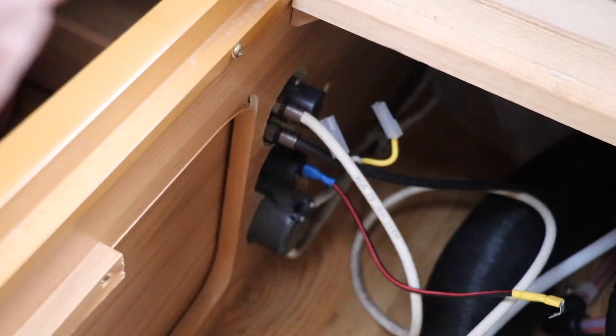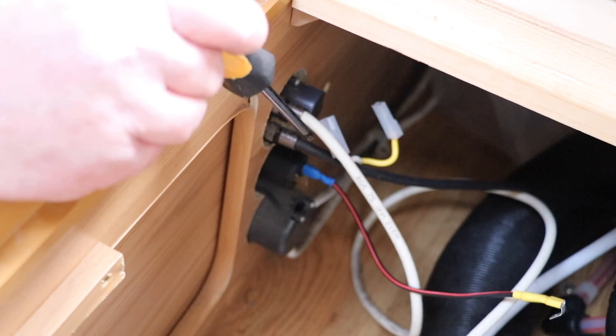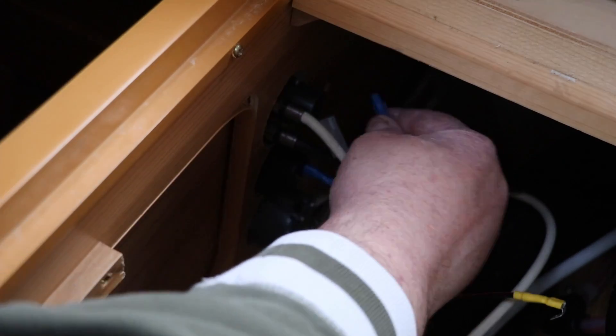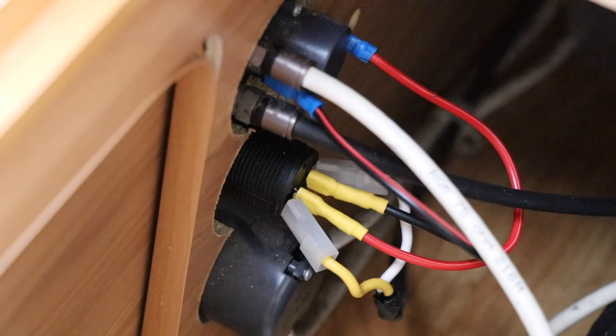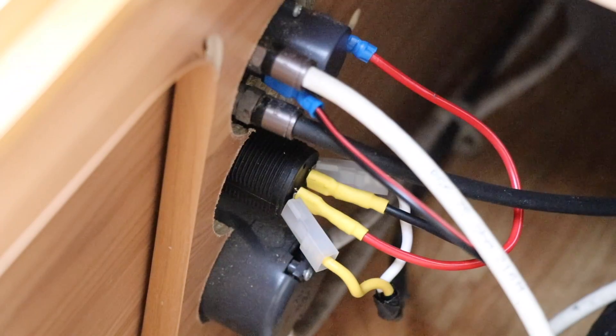I've changed my mind on how I'm going to do this because we're quite close to these coaxial connections here, so I'm going to fit the blue end onto here and it'll be nicely insulated as well. It may not be super obvious but we've got the plugs on the top there which go into the corresponding sides - this is the negative side. By the time they get down to the bottom they actually cross over because of the orientation of the USB socket down below. You do need to make sure you get it round the right way - if you don't it just won't work. There are diodes inside so it just won't work. Make sure it's correctly wired up. And that's that wiring now complete.